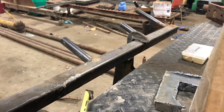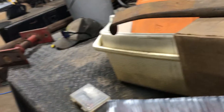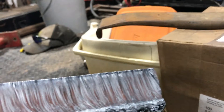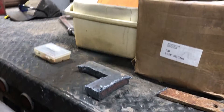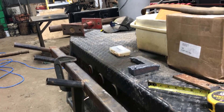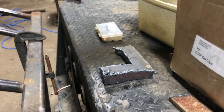My conclusion, to answer the person's question on whether the 65 is big enough: the 65 is definitely big enough to do most jobs and will obviously cut inch material fairly clean, but I would not want to do it a lot because of the time involved. I think the extra power you get with the 85 might be worth it. You can see how long it took to cut that 4.5 inches and use your own judgment. It's all shot live — I'm not trying to edit much so people don't claim trickery. I'd say 3 quarters — I'd be very comfortable cutting a lot of 3-quarter inch with this. But cutting a large amount of inch material is very questionable.